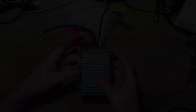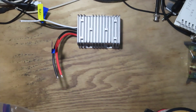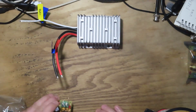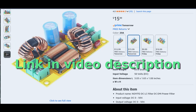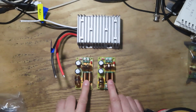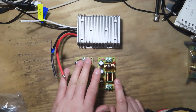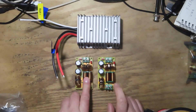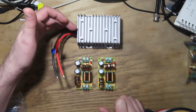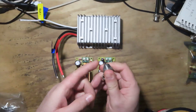Here are the parts: a 300-watt DC-to-DC converter, 19V out with 12V in. On the input and output I've got RFI filter boards that work well at lower frequency ranges. Since these switching supplies operate in the hundreds of kilohertz range, most interference on the power leads will be in the lower HF spectrum. The input filter keeps RF noise from going out onto the power rail.